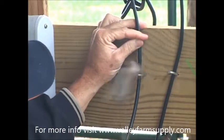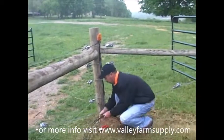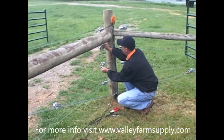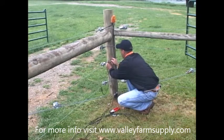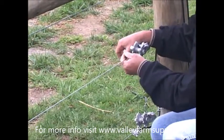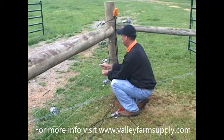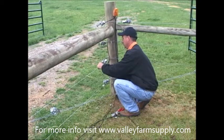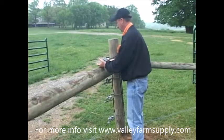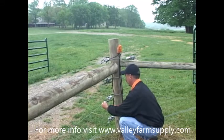Now roughly estimate the amount of double insulated cable needed to connect all of the strands of fence. As previously done, remove an inch long segment of insulation from one end of the cable. Using a joint clamp, attach the cable to the bottom fence wire near the insulator. Now arrange the cable so that it runs up the post to the next wire. Using a joint clamp, attach the cable to the next fence wire near the insulator, and so forth all the way up to each wire. Just continue to cut additional segments of insulated cable to enable connections between the remaining fence conductors, connecting them with joint clamps. Make sure all the joint clamps are tight. Repeat the process of connecting your circuit at the other end of the fence and you will have your completed circuit.